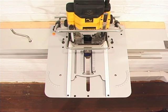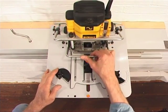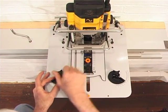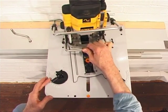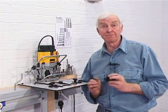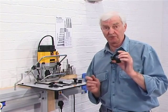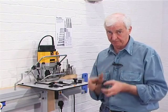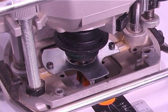Up to now, we've used the Woodrat with the guide rails in place, working square. But for dovetailing, we need to reconfigure the machine because we'll be needing to cut not only straight, but also at the dovetail angles. The Woodrat makes dovetails in a totally different way than a dovetail jig. You'll have noticed that there's no talk of guide bushes anywhere. It just does not have them. With the guide bush in the way of the cutter, you're just cutting blind.